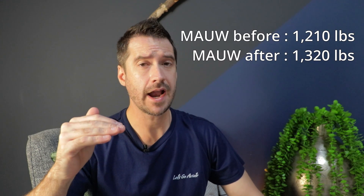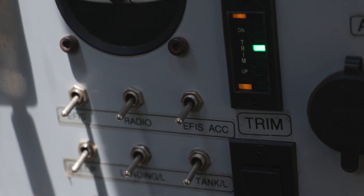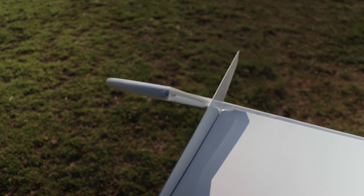The new tail actually ups the maximum all-up weight from 550 kilograms to 600 kilograms — same as the latest Bushbaby you can buy — meaning an increased useful load. The upgrade also comes with electric trim; worth mentioning we didn't have any elevator trim at all before, so this is a nice upgrade. And my favorite improvement is the balance horns at the end of the elevator. They are the portion of the elevator in front of the hinge line and reduce the force needed to move the elevator at all air speeds — it's basically power steering for your elevator. Drop a comment below if you have any questions, hit like if you found this informative, and see you in the next one.